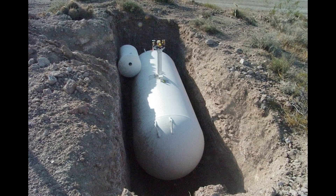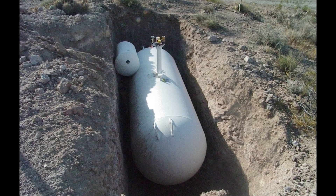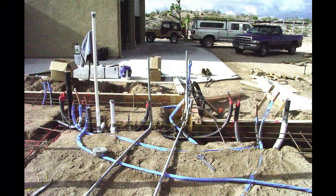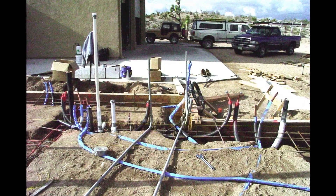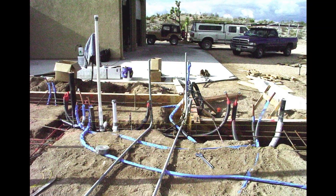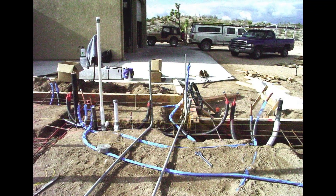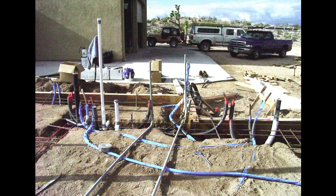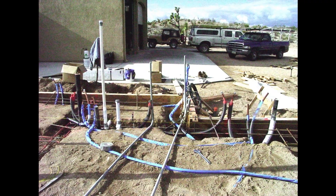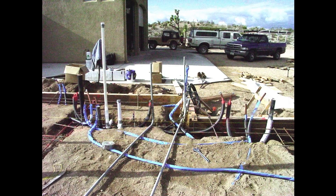Or perhaps it was trying to protect more than the tank. That's when I remembered I had piped all the gas pipe in iron to the house, and the rest of the gas pipe is all metal. I began to suspect that the pipe and the tank were all connected together, running through the whole house with no dielectric separation. And I began looking for a dielectric union and could not find one.